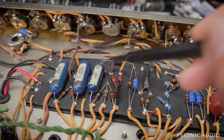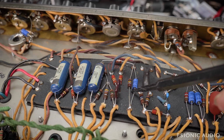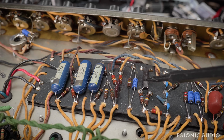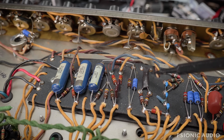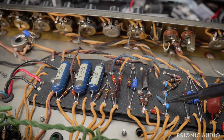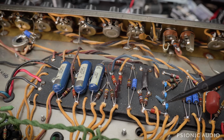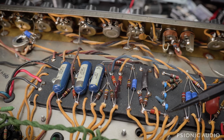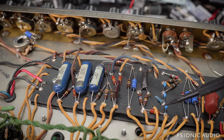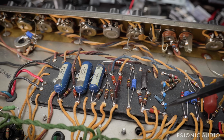I've got some slack on the leads of this 100 ohm here and the PI, because that often gets stressed and pulls out. The 4.7 microfarad versus the 22 or 25 I mentioned in the previous video here. And we did have a bad LDR specifically, previously, which is why the tremolo wasn't working. And it had the 20 nanofarad, 22 nanofarad film caps here. I've gone to these little 1,000-volt ceramics, which are fantastic for this purpose, because they're never going to drift. They're never going to become microphonic, and they shrug off the voltage present. So back to 22, 10, 10, the vintage Fender spec. You'll get to hear that soon.